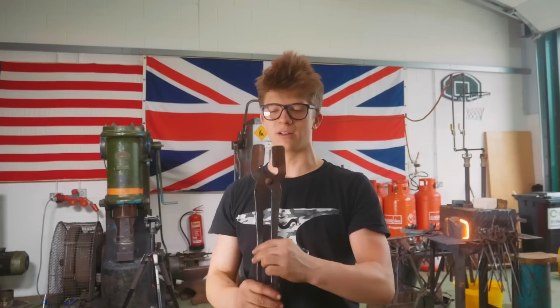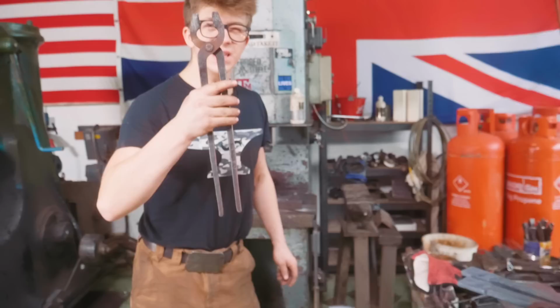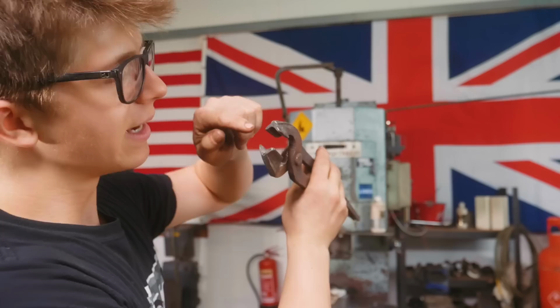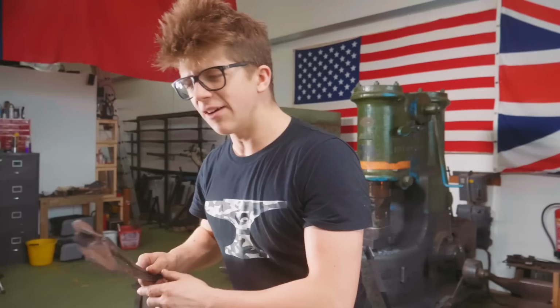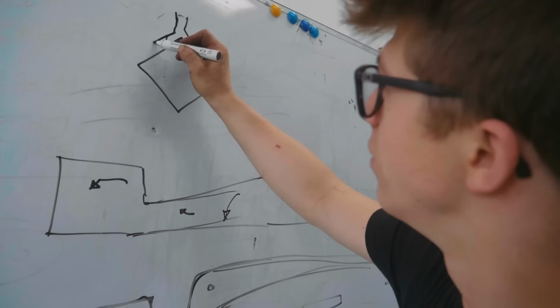He made these tongs, but they're 1 1/4 inch, and I need 1 inch tongs. Because in my rack here, of all the tongs, I don't actually have 1 inch tongs. I've got these lovely tongs, which were built to be 3/4 inch tongs, and I use them as 1 inch tongs. But the issue is that when you take a pair of tongs that's built to be a smaller size and you open them up, these little V's here end up being too small. And what I love about these tongs is those V's, when seated on the square bar, they don't just grab the top corner of the square bar, they go down nice and deep over the square, and that means that we get a stunningly secure grip, which I really, really like.